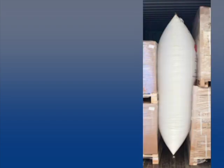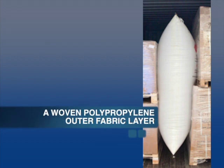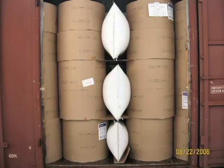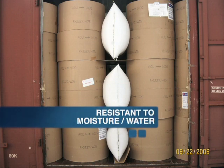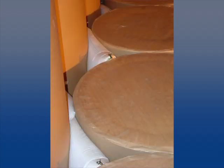The 100% polypropylene bag is strong and durable, made from a woven polypropylene outer fabric layer and an airtight polyethylene inner bladder with an inflating and deflating valve. The lightweight bag is easy to handle, takes up less space, and is resistant to moisture and water penetration. Bags are flexible enough to fill every shape and odd space between cargo up to about 18 inches, and they are easier to install than vinyl bags in tighter, hard-to-reach places because of their rigidity.